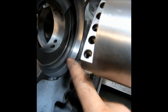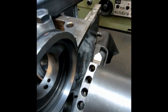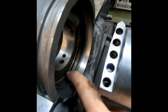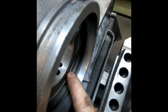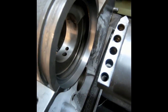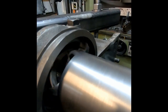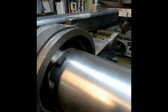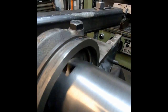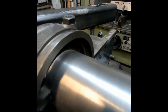We've got a step right here, and the majority of this step is a really thin piece of material left over from doing the boring. What I do is throw one of these 60-degree tools in here and go in until this whole thin piece breaks off, and it'll leave a nice chamfer on the step that's going to remain. I fire the machine up and just hand feed it — the material lifts off, and then the chamfer is cut on the remaining little step.